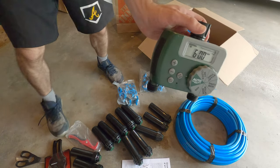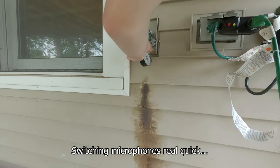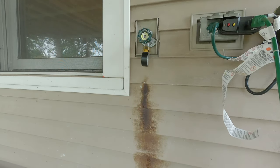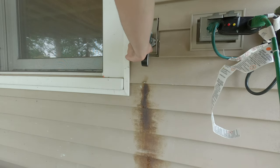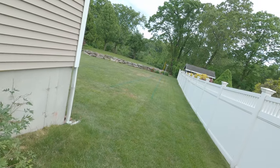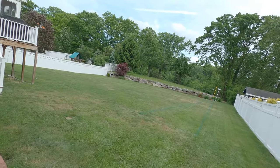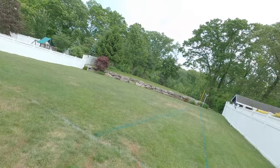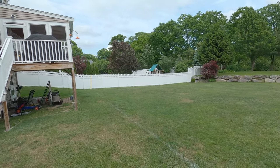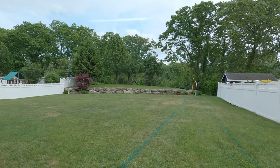And last but not least we have the timer. The first order of business is to check my water pressure in gallons per minute. The gauge was reading 60 PSI, which is a little lower than usual at my house as it's usually around 80 — it'll still work just fine. I grabbed a 5-gallon bucket and it took me almost 30 seconds to fill it, meaning I have around 10 gallons per minute at this faucet, which is plenty for what I'm doing.